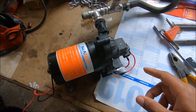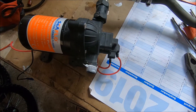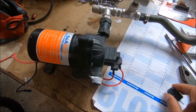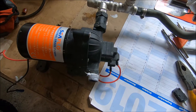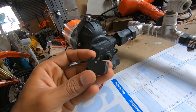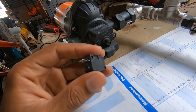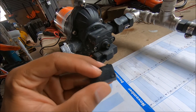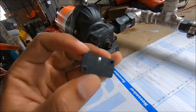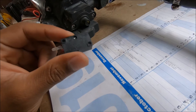The pump was getting stuck, and it came down to this pressure switch here. After opening it out, I found that the pressure switch had pit marks on it because it overheated from cycling on and off — the pump wasn't adjusted correctly. I removed these two screws and took off the pressure switch. Inside there's a small micro switch. I drilled out the rivet and opened the switch up, and found that the contacts had blackened and pitted.